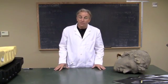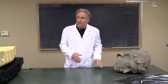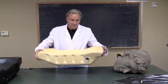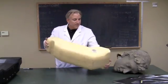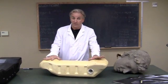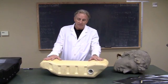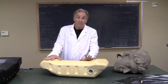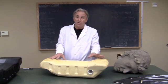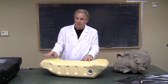Molding foam is a fantastic material. As mentioned earlier it can be used as a flotation device or as a filler. In this case the customer wanted to create an actual float with no coating out of the three pound foam, and you can see it came out very nicely. If the foam is being exposed to UV light it should be coated with a urethane or acrylic coating for better UV resistance, but it has excellent long-term resistance to salt water and fresh water — much more than EPS, what most people know as styrofoam.